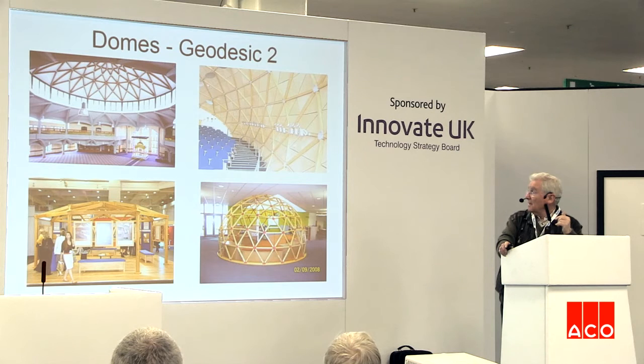I haven't done a real one — that's just an exhibition stand — but if anybody wants to have a go. The bottom right-hand one is probably the only pure original geodesic geometry where the number of lengths is very limited: I think there are two or three different lengths. The plates are just flat metal, profiled and slightly bent, and the timber is slotted. The timber slides onto the node, so there's a lot of repetition of something like 50 by 50 with two to three millimetre thick plate joints. Very simple — it's in a nursery school to give some private space for elements of teaching.